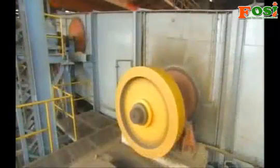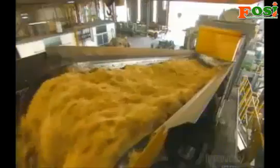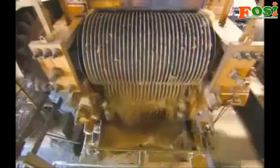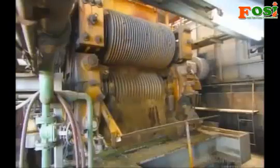But first, the cane's hard structure is broken down inside a crusher, where rotating hammers break the cane into small pieces. A conveyor loads it into a milling tandem, designed to extract the sweet juice from the crushed cane. In this milling tandem, the cane passes through a series of five or more consecutive mills, where large cylinders compress the cane fiber. The juice pours out of the milling tandem and diverts into a channel away from the bagasse — the dry pulp that remains after extracting the juice.